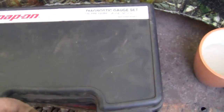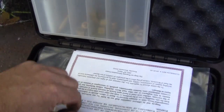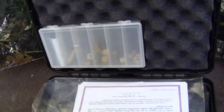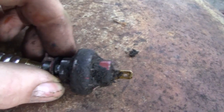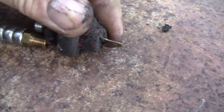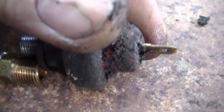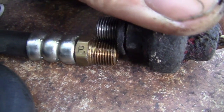I'm going through this fitting kit to see if I have the right thread. Being British, it's probably metric — I'm not sure. I have a whole bunch of fittings here. To figure out the right size before screwing it in, I held it up — the diameter is exactly the same — and then I held the threads together to make sure the pitch matched. It does match.